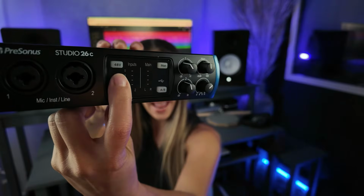Check out Focusrite, Presonus, Arturia, Apogee, and Universal Audio. One thing to keep in mind is condenser mics don't have a power source, so they rely on what's called phantom power, which is a little button on your interface that says 48V. We'll talk more in depth about setting your gain level in the next video, which is the amount of loudness you're allowing to go through the mic.